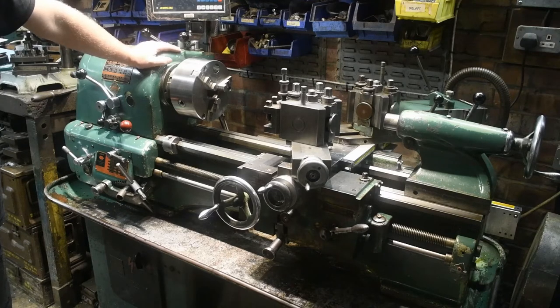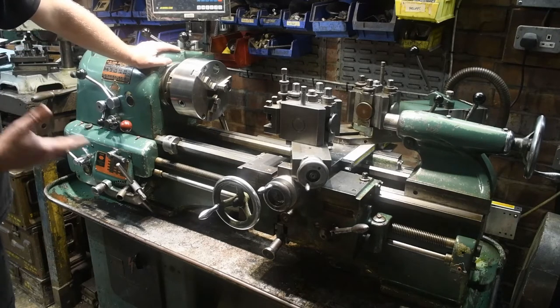I have a few projects coming up where the tracer unit would be very handy. The tracer unit itself works very well. I've had it powered — it's a hydraulic unit. I've had the pump up and running and replaced the hydraulic oil with fresh oil. The actual unit itself moves under power, and you can put pressure on the stylus and it resets and traces out.